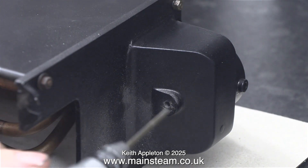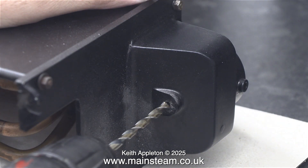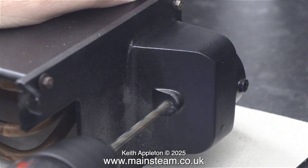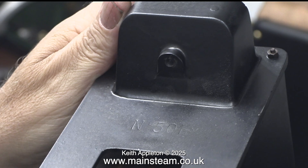Here I'm drilling the hole a little bit bigger using a 1/8th of an inch diameter twist drill. There is another method I could mention — making a jig and drilling it from the top in one go — but because of the angle inside this chimney holder, I was a bit worried about the drill bit wandering and coming out in the wrong place. Besides, from experience this method seems to be a good way of doing it. Once I drilled the 1/8th of an inch diameter hole, I then used my small Bosch electric drill to open up the hole to 3/16ths of an inch in diameter to take the 3/16ths pipe. The main thing is the hole is in the correct place — or at least I think it is. It's in the same position relative to the 504 boiler, and it really doesn't matter if it is slightly off because the copper pipe can be bent to go up the centre of the chimney, and in any case this is only cosmetic.